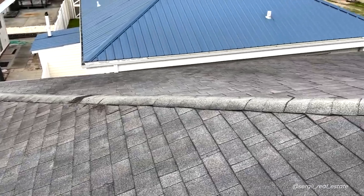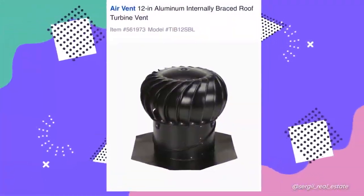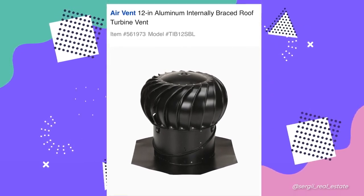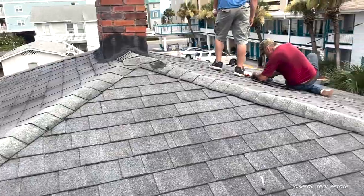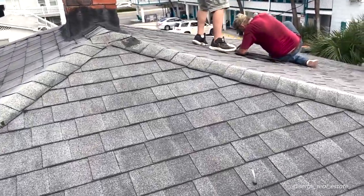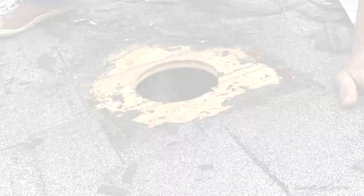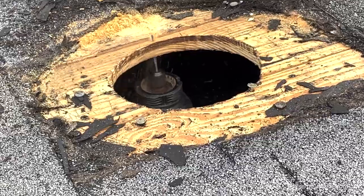Here is the solution and our way to fix the problem. We installed three 12-inch aluminum internally braced roof turbine vents by the Air Vent brand. They don't cost too much at all — you can easily find and pick them up at Lowe's. My roof has four sides, so we installed on three of them.